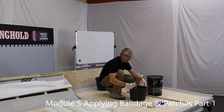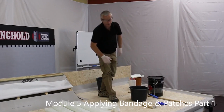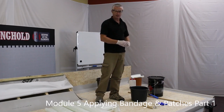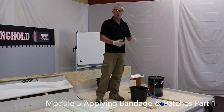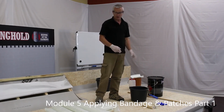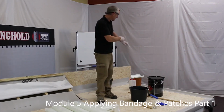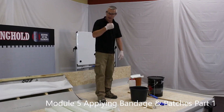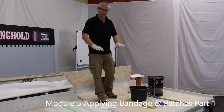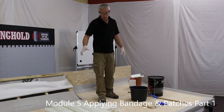And I'm going to leave the laminator roller on the side of the bucket. Now, important when you're roofing, polyester resin is very slippery. It's a bad idea to make mess everywhere without being conscious of where you're making the mess. The safest work in practice is to start with the front corners of the roof, then do any other corners or joints, and after the joint details are completed, we've got the bandage around the edges and then apply the area.